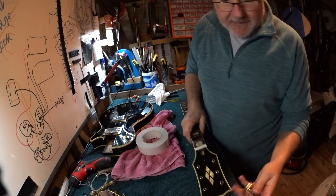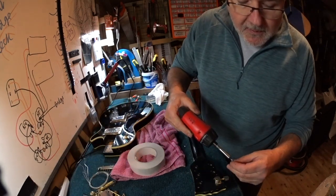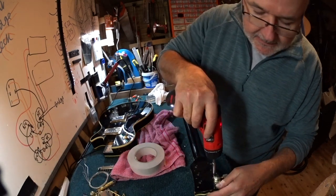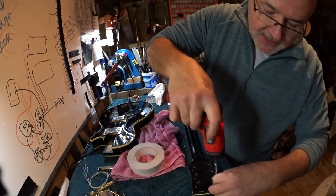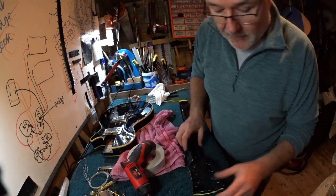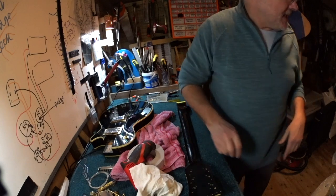So next stage, you get these chaps in there like that. Now these probably are a bit tired, these screws, so we're going to treat them with great gentleness. Yeah, they're too tired. This is a pain in the backside, but we're not going to get anywhere if we just put them back in on there. So the only choices we've got are to fill these and then re-drill. I think that's what we're going to have to do. It's a pain. It's going to take a bit longer, but there's no point in trying to stick them back in. They'll just fall out.